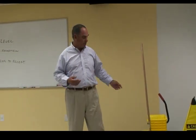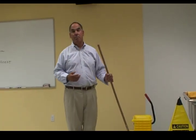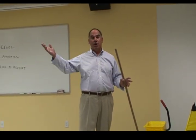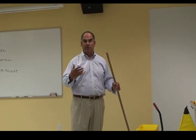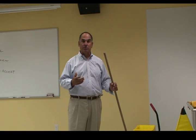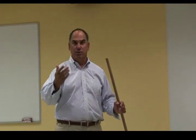Miss Coat Products recommends multiple coat acrylic floor care systems, so the more coats we put on this floor, the better protection we'll have in the long run, and the less we will need to strip. This will be my second coat. It will be applied just like the first one, and over time, you'll see subsequent coats will bring the gloss up to a mirror-like finish.